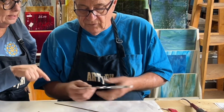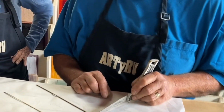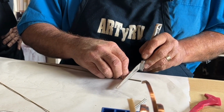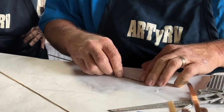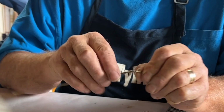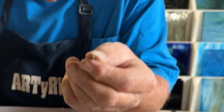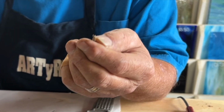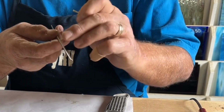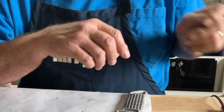Okay, so what size do we cut this? We're cutting these approximately 1 inch long. So these hinge parts are going to be approximately 1 inch long. Okay, so we cut just a little notch on one side here, and now that'll break it. Our hinge hole for our small hinge pin is not compromised now. You have to notch it till you go into the opening of this, and then you can fold it over and it will not pinch it. So the hole is open.